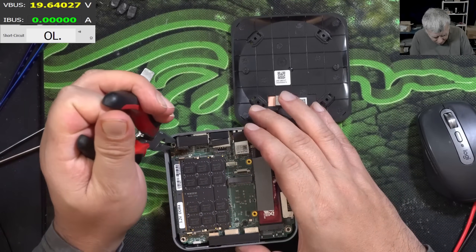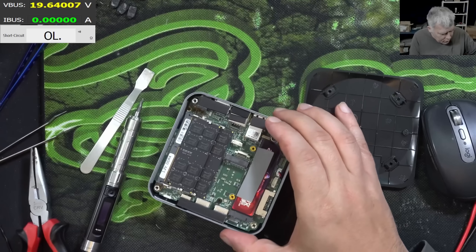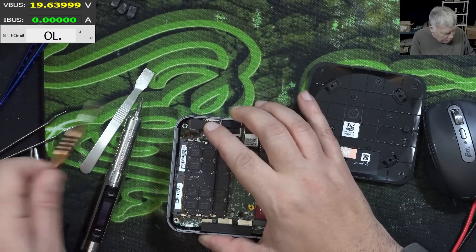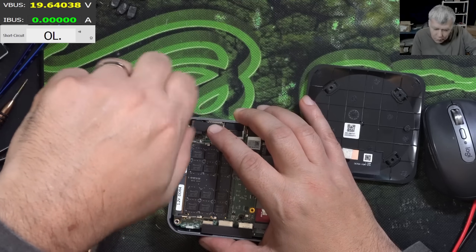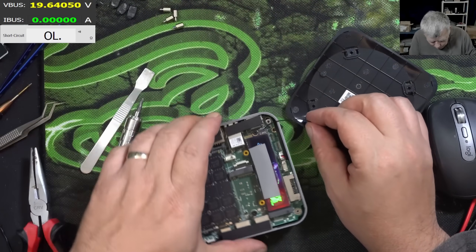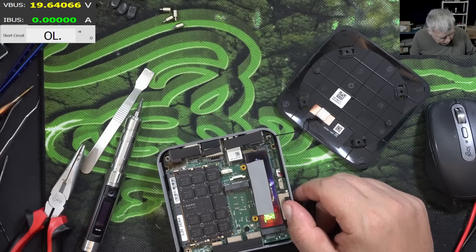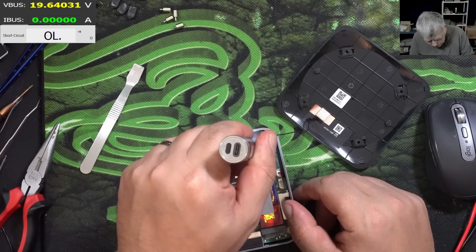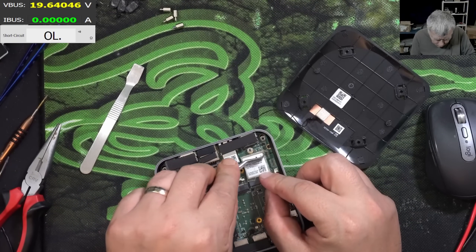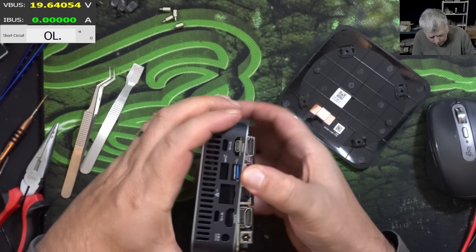Maybe it's a MOSFET and the CPU has zero ohms — we don't know yet. Remember if we fixed one before and it was like the five-volt power supply that blew up? It was not an easy job but we fixed it. Okay, the board screws are out. Actually one Wi-Fi antenna is on the other side and one on the back — so it has two Wi-Fi antennas. The M.2 drive is out. The Wi-Fi connectors are out. Now let's try to take the board out — looks like it's coming.